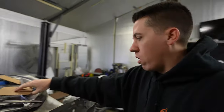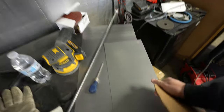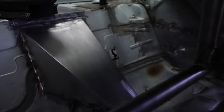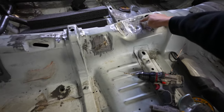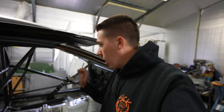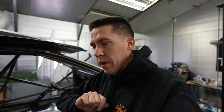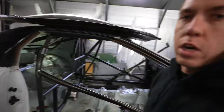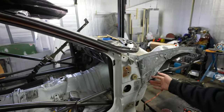I transferred the cardboard template to some metal — I already did that. I ended up picking up some 16 gauge metal last night; it's a little bit thicker than the other metal I've been using in the car, but I already laid it out so I just need to get it cut out and then hopefully tack it in and weld it up. Another thing I did last night is I knocked the little plug out of where it was riveted in. Today I'm going to weld up a couple more little holes where I had self-tappers, grind all that, and really try to get all the metal work more or less completed. Then we can start using just a little bit of body filler icing to smooth all of this out and then paint the interior. I'm going to use the Tiger Bond from the bottom side to seal in all that metal as well, to make sure we don't get water coming up in it and starting to rust.